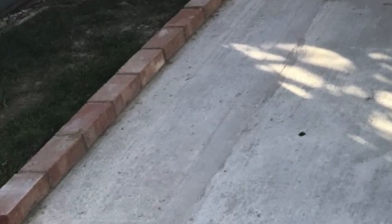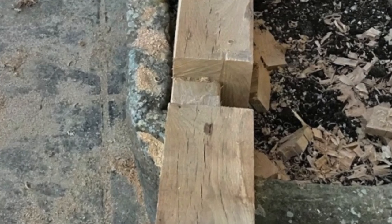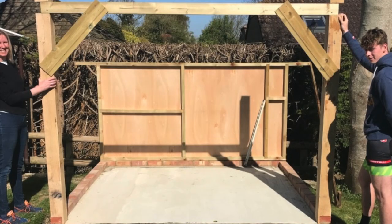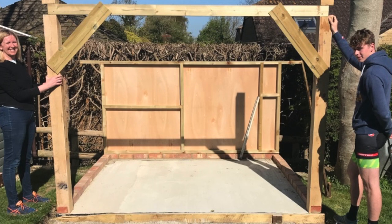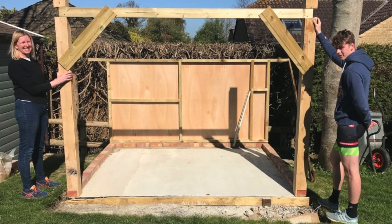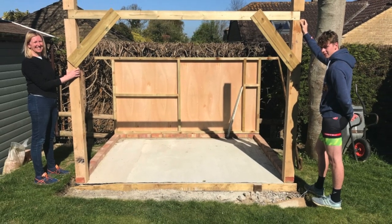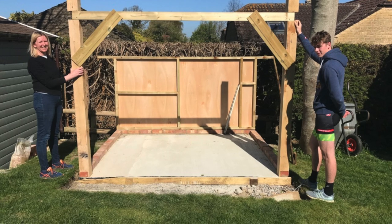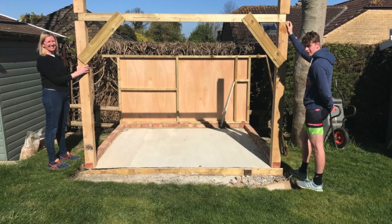I opted for some fairly large oak timbers for the front elevation. These were first of all cut to size and notched for assembly into forming a framework and then trial fitted. Despite a fairly accurate set of drawings, there's no substitute really for trialling a structure in its final position. And once I'd done that, I quickly realised it was initially too high and a bit overbearing really for the size of garden. So I lowered it by about 3 inches.